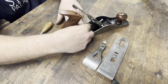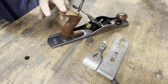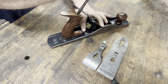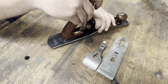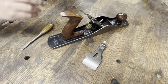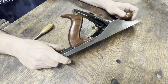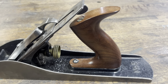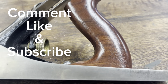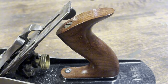Now it's time to see if the tote will fit on the plane. First I attach the small toe screw — I don't tighten it down, just set it in place. Next I go ahead and attach the main rod; you can see it slides back as I tighten it up. Once I get it where I want it, I'll tighten the front toe screw and secure the tote all the way down. Then I'll set the iron back in along with the lever cap and try to wiggle the handle to make sure she's firm. Comment, like, and subscribe if you like this video and I'll make more. I hope this was helpful if you decide you want to make a tote for your planes. Thank you for watching.